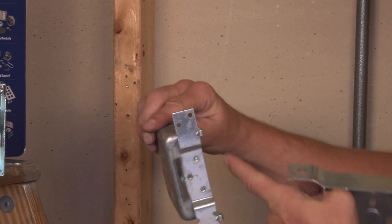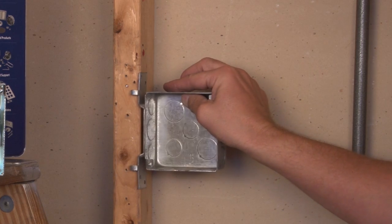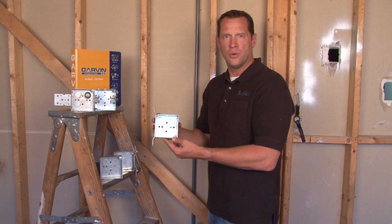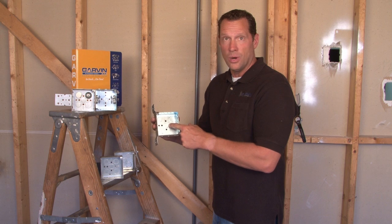And a vertical bracket with wood spikes that can be mounted into the face of the stud for a rigid application. These inch-and-a-half deep conduit boxes accommodate half-inch and three-quarter inch conduit. They do not have a grounding provision in the bottom because they do not need one.